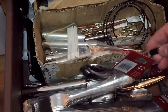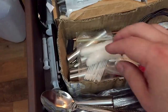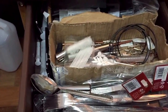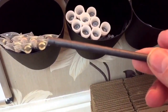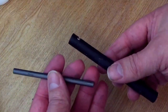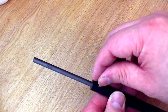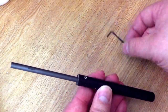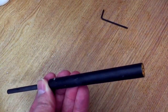Right, this is what I use. First of all the spoon — the cheap one from the pound shop — and a swab. You can get these from my eBay shop, I'll tell you later. And a carbon electrode with an electro handle. I'll show you how to put them together. Put it in there, but because it's carbon it's very soft, so don't tighten it too much, only a little bit. Carbon electrode can be used for any plating — gold, silver, platinum, whatever you want.